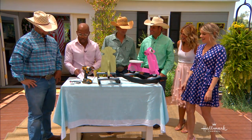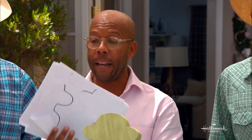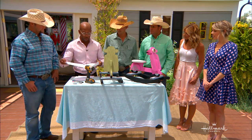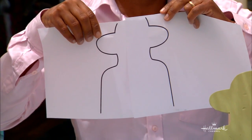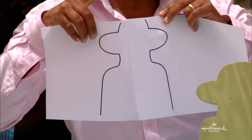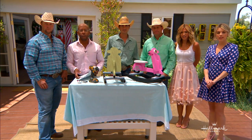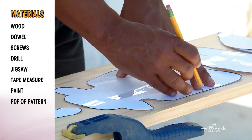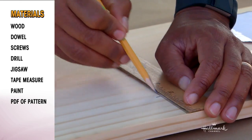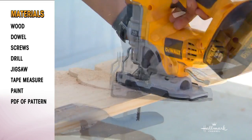It does look complicated, I have to say, and I have to give Anna a great shout-out. What she did was — you go to her website, we'll have a link to her pattern on our website — you print out the entire pattern on 8½ by 11 sheets, tape them together, and you get your entire pattern. The whole thing you can make out of one 1×10×8 board — one piece of wood, about 15 bucks. You cut out the patterns, trace them onto the wood, and then get your jigsaw and go to town.